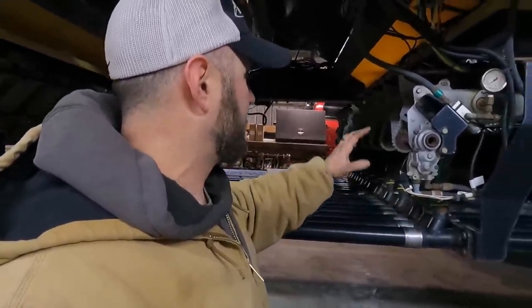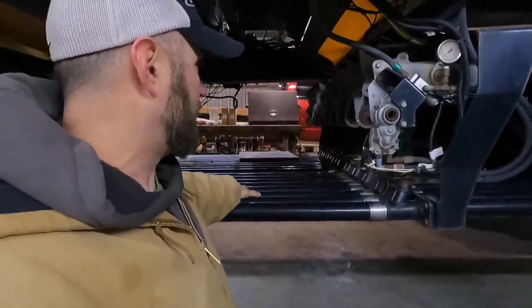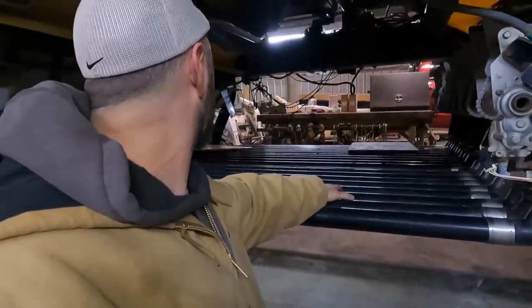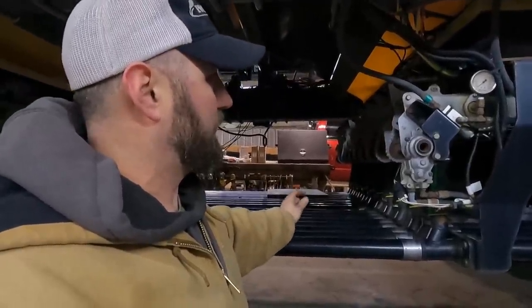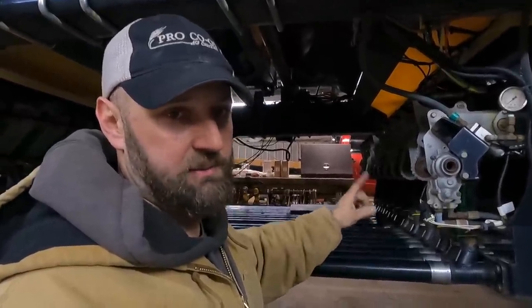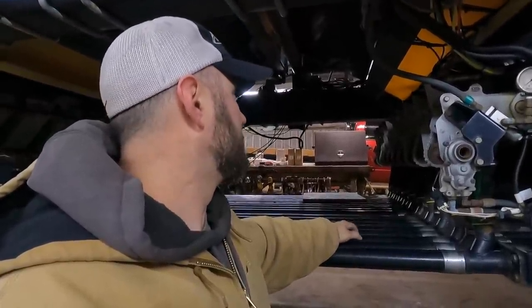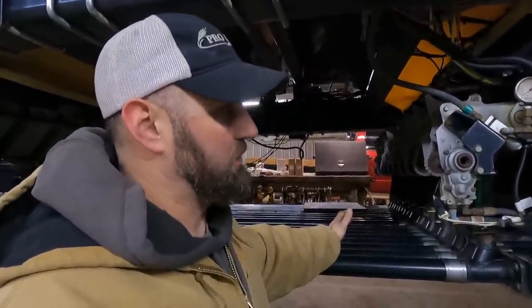So we're going to put new manifold Ys on down here, a whole bunch of tubes, and then rebuild these meters, put new seals and bushings in them. Honestly, we've gone, I don't know, 70,000 acres on this drill and never replaced those bushings. We should have done that a long time ago, probably. But we haven't had any troubles that we know of.